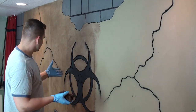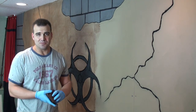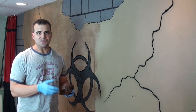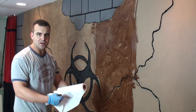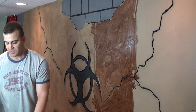But it is so worth it. The look is something you can't get from paint — this video isn't going to do it justice. You're really not going to get this look with paint. Stain is really a great way to go. You definitely want to change out your clean rag all the time. I ran out of cheesecloth, so now I'm using paper towels. All works the same.